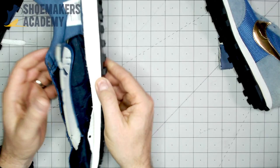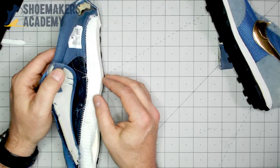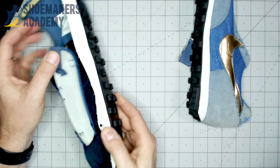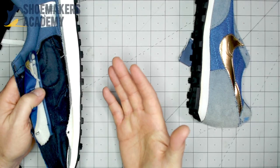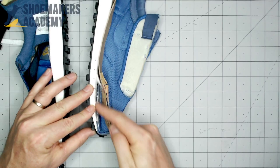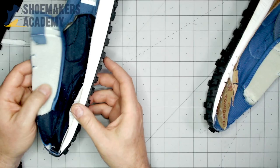Here's a fake version, and this shoe has been strobeled. The question came up: when you're looking at a strobel, does the strobel have to be the same size as the last bottom? The answer is no. Here's a case where, in order to get the upper to wrap around so you can have a flat top midsole, they've reduced the size of the strobel to pull the material in. That's why the material wraps around the corner and goes flat so that the strobel is bonded to the fit. Why would they make the fake shoe this way? Maybe to save material — in a board lasted shoe you're taking your most expensive material, the leather, and wrapping it underneath the lasting board. In a strobel shoe you can stop it short. The strobel is also probably faster to make.